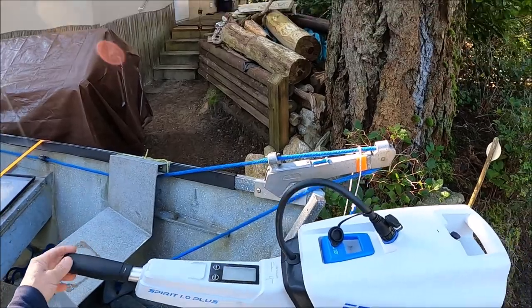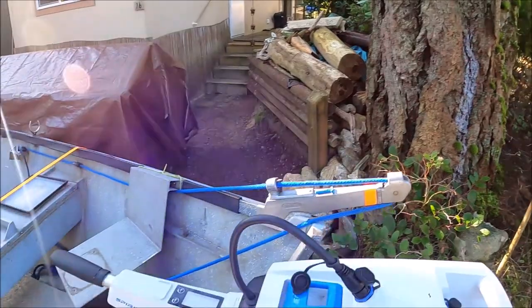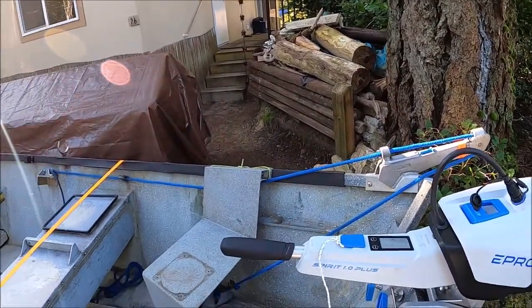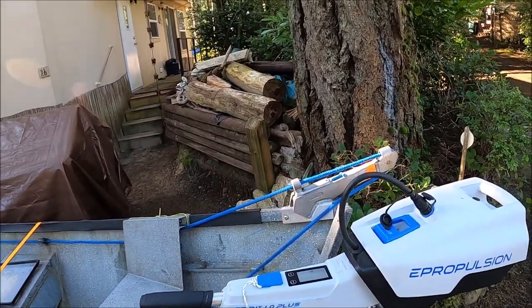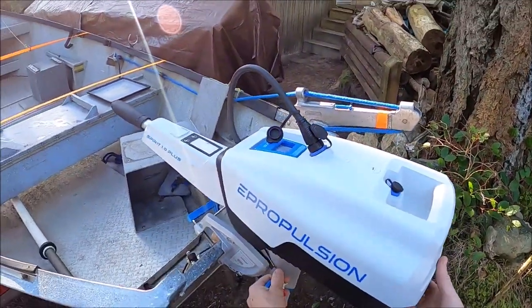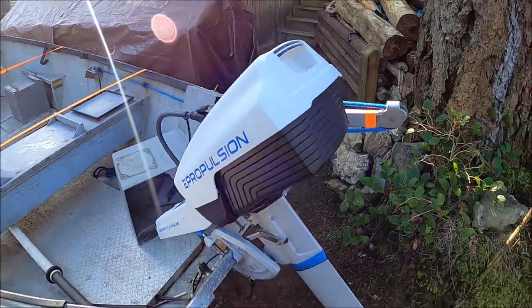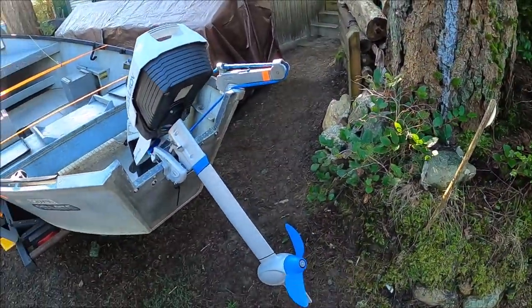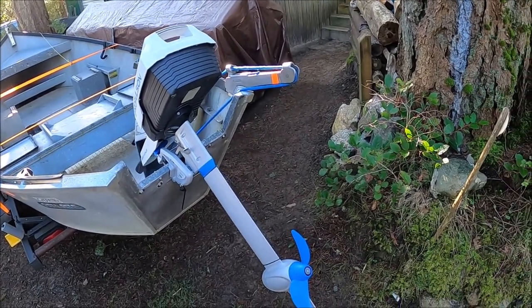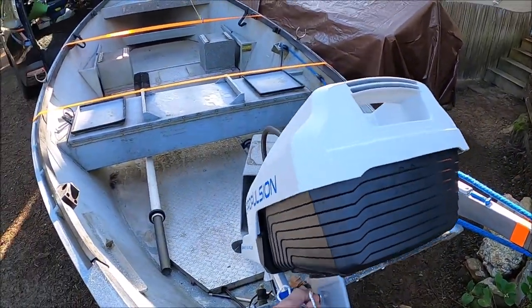With the pin out you can now steer. The safety is through a magnetic key — you get two of these with the motor. It sticks on there and you clip it to your PFD so it'll shut off the motor if you fall overboard. The way it tilts is right here — give it a pull and it locks in an upper position. Prop is set for about six miles per hour maximum speed no matter what throttle setting, and that's pretty much it.